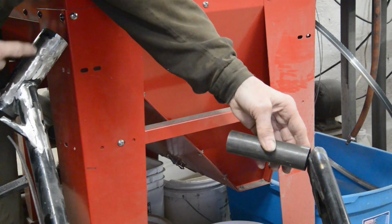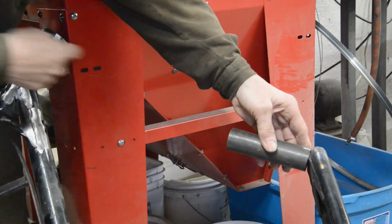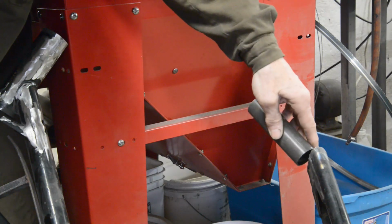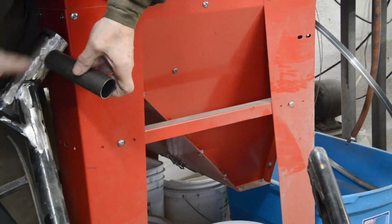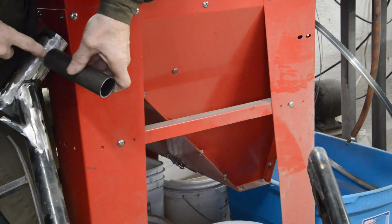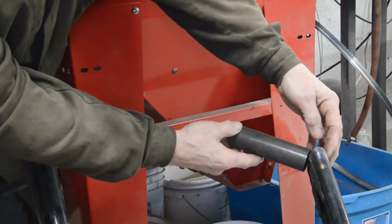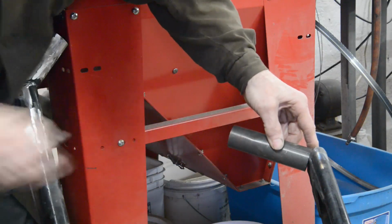Make a piece of tube long enough to go right past here. Then when that end's done, I'll measure this. I start to cut it a little bit at a time and slowly drop this in. I pivot it on there and drop that in and drop it in until it fits. Also, although I can get a pretty good joint here, I'll be honest with you, it's never a brilliant one here. But because of the two tubes that are going to go there, this is all going to be gusseted. So I'm not overly worried.